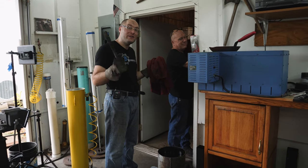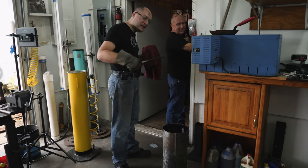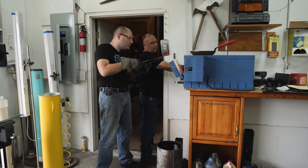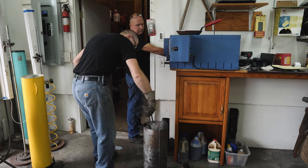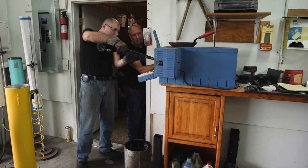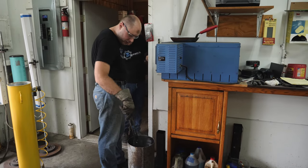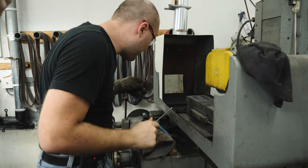The blades are up to 1525°F and have been soaking for a minute or two. I'm going to have dad run the kiln door opening and closing it, and I'll take one out and quench it at a time, pull it out, and lay it on that shirt, then take the next one. All right, number one — quenching them one by one. Once they're cooled down I'll wipe the oil off and scrape a file across them to see if they got hard. That one's definitely hard.